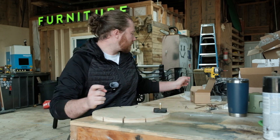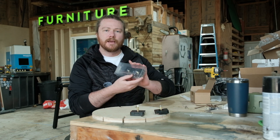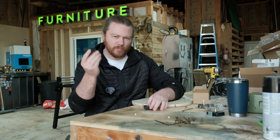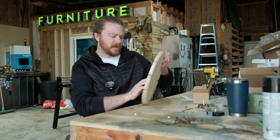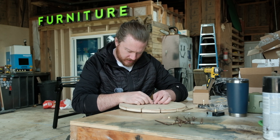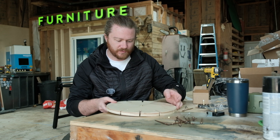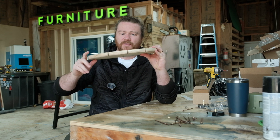I went ahead and bought three different clock mechanisms. We've got different post sizes and more importantly they come with different hands too, so you can see I'm using three different manufacturers. They're all fitting in this hole. It comes with a rubber washer that goes on the unit before the unit goes into the pocket, and then there's a brass washer and a brass nut. I'll put this one listed first in the clock parts because I like it the best as far as how it fits — it fits great with three quarter inch material, although it does still pop off the back a little bit.